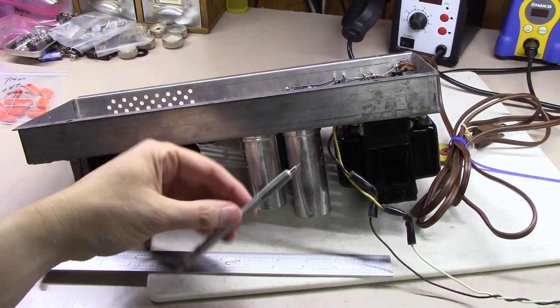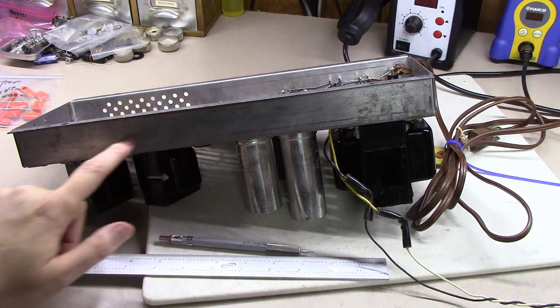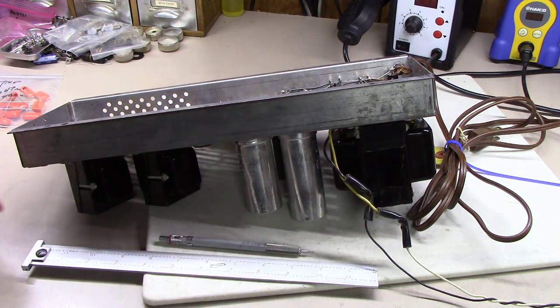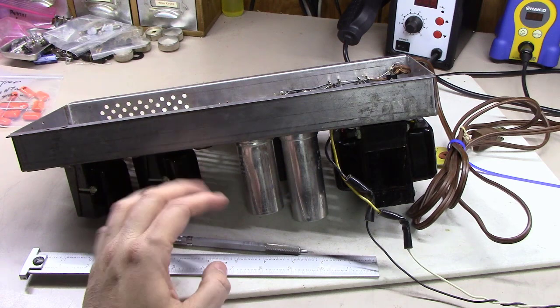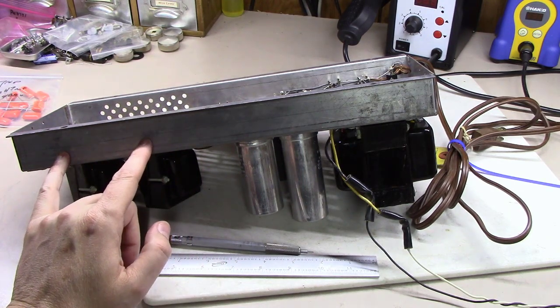Okay, I like to use a mechanical pencil or pencil of some sort, and I've drawn a line. It's kind of hard to see, but right down the middle of this amplifier on the back side here, and it'll be something that'll just rub right off with ease. You can see it here a little bit, but that gives us a center line for putting in the output. So I'm going to come as close to the output transformers as I can get